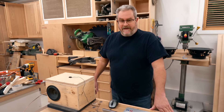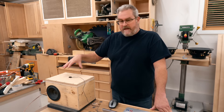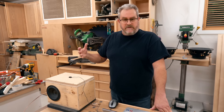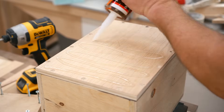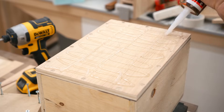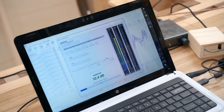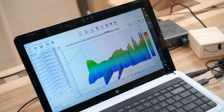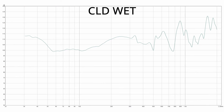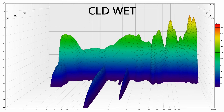I've got one more thing to try, and that's what's known as CLD — Constrained Layer Damping. That's where you take a panel and glue it to another panel with a flexible adhesive in between. In my case, I'm using silicone, spread on liberally, then sandwiched with another MDF panel on top. There's no harm in testing it while it's wet. Even though you're not reducing as much down low, the response is flatter overall — you're losing more up in the high end, which I think is better overall.